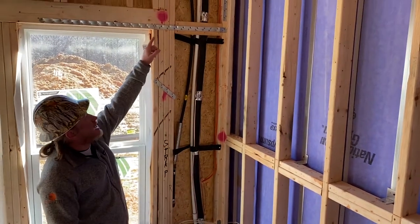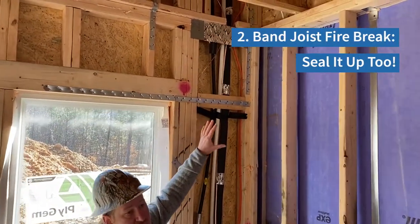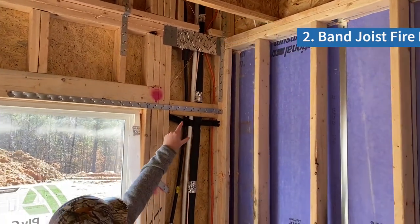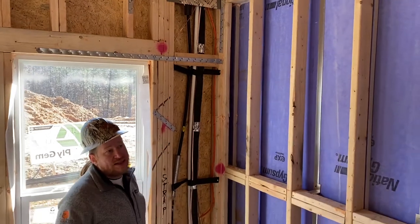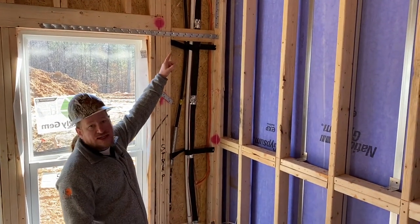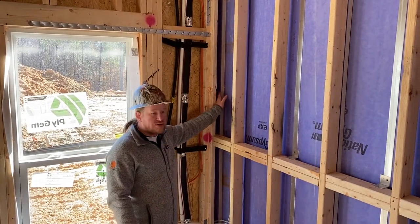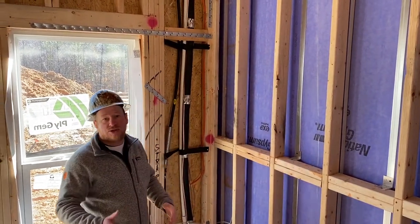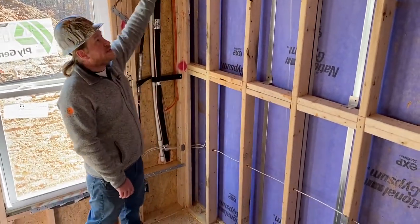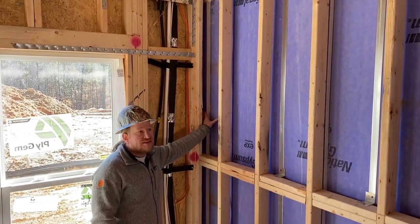What we don't want to forget is the band joist detail. That's closed up here and we can't really see what they did, so we're going to have to have some faith that it was well sealed. But the same gap extends in that band joist space. The reason I mention that specifically is because it is generally covered up and it's often overlooked — maybe more often than this vertical gap right here. We want a complete air seal all the way from the slab up to the attic at this exterior wall interface of the party wall.